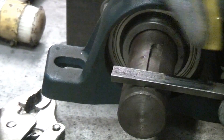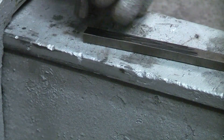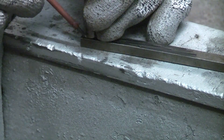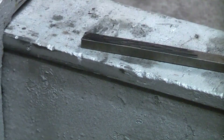I'm now colouring the key steel — you can do this with engineers marking out fluid or a permanent marker. This is so that you can see the scribe line easier. Once you have measured the slot, if you get a drill bit of the same diameter it should have an almost identical radius, so you can use this to scribe around.